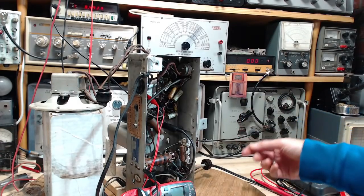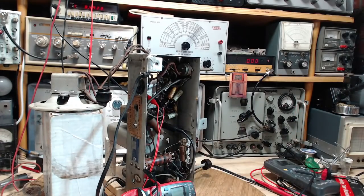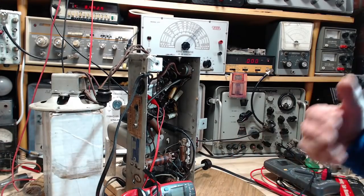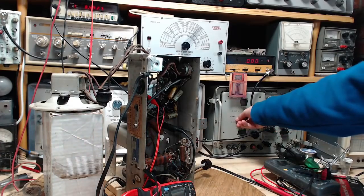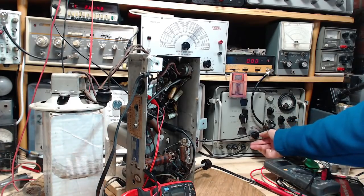One more band, we might as well check it out. Okay, we'll go to the other band in the middle. The shortwave band goes from... cabinets here. Let me look. Let's see, it goes from 2.3 to 7. Oh, it contains the 6 megahertz band. So both these shortwave bands are actually important because the 6 megahertz band is something worth listening to. But we're at the low end, so we're down around the 2.3. Well, what would we be? We'd be around the 2.5 locale. Okay, let's go there. So 2.6. Very strong signal.